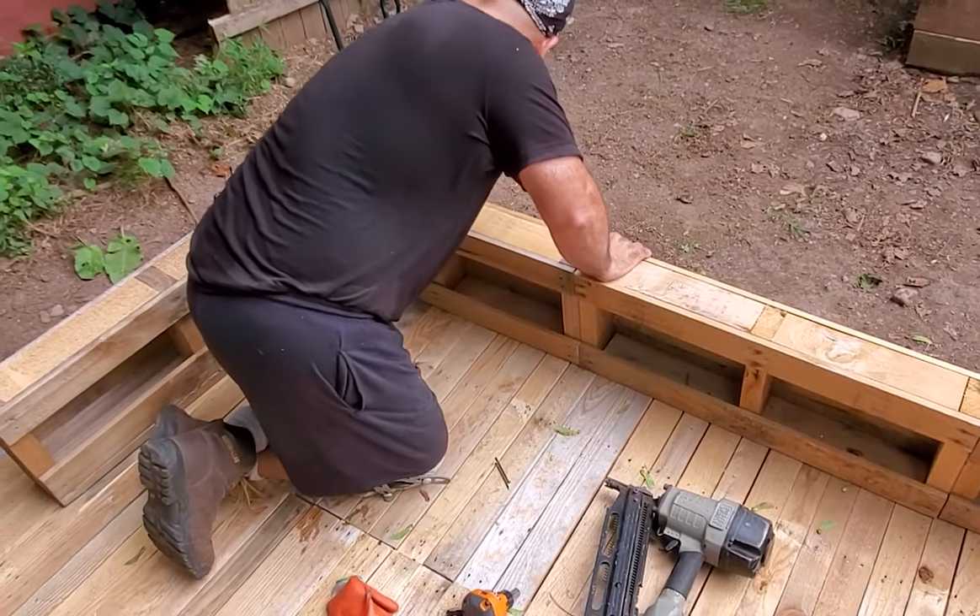I've added all the extra supports. If you look up, they're about 65 inches wide, so by putting an extra pole in the center on both sides it'll prevent the panels from sinking in when it snows or rains. I have one more to demonstrate. The poles are leftover parts from a tent that had a big branch fall on it — they're 1-inch and 3/4, and you can find these at Home Depot and just cut them to length.